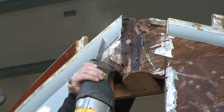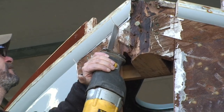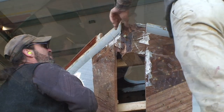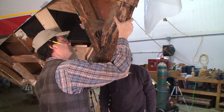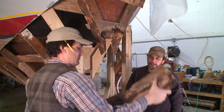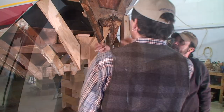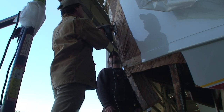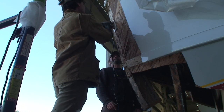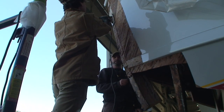The complete opposite of how you normally build a boat — everything is that way. And we're going to start with a step of repairing the keels inside the boat, and then the next stage would be to replace the frames and the floors. We'll draw a line, then we'll cut the planking back about two and a half inches on either side of the apex of the stem in the front here. Once we do that, the stem will be free and basically it should come out in one piece.